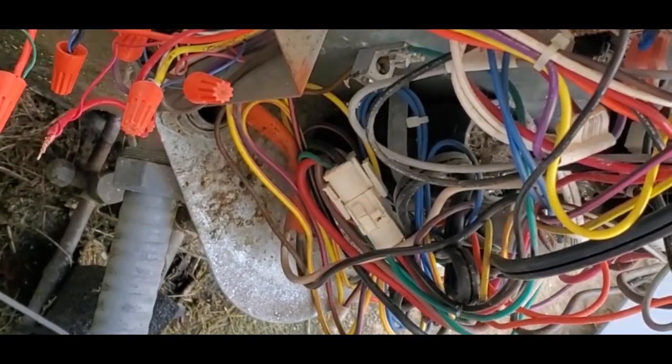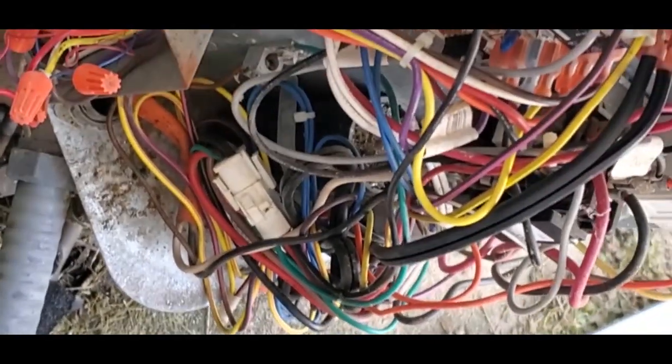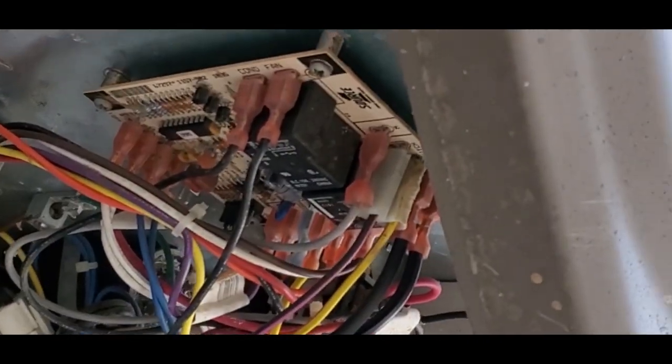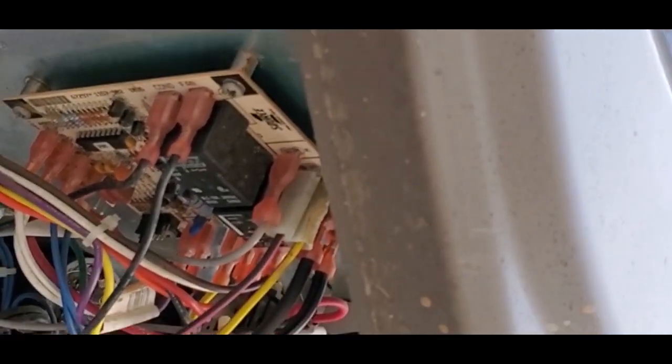So now we've got the proper voltage. We had a bad thermostat which caused the improper voltage, and we had a leak on our reversing valve. So we changed the reversing valve, changed the thermostat, and went ahead and changed the solenoid coil because it got really hot — I was afraid that the duration of the problem could have caused a short lifespan and it could have failed down the road. If this video helps you at all, please go to patreon.com/TaddyDigest and subscribe. Thanks.